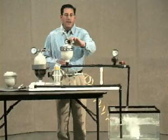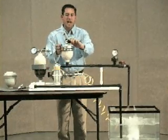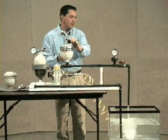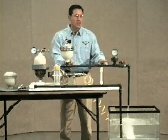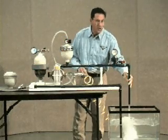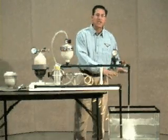Now, I'm releasing the air that's inside the dampener, and I'll begin to tune it in. When I bring it within a few pounds lower than the discharge pressure, you see the pipe lays flat. There's a nice smooth laminar flow, no splashing or shaking.